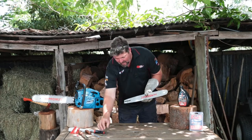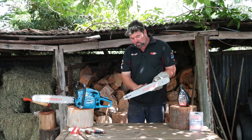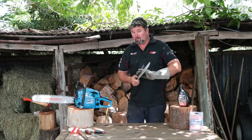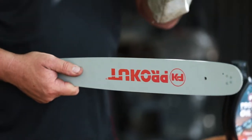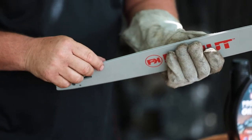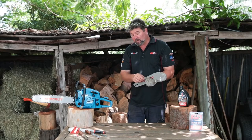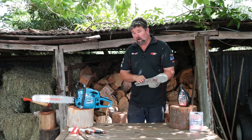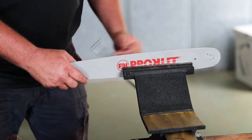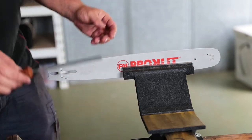Other things that happen to bars during use is wear on the upper surface. This is a new bar, but rubbing your hand up and down could cut it, so wear gloves because these can be razor sharp. In order to get the razor burr off, we'll need to draw file the bar. This will need to be clamped into a vise and filed along.